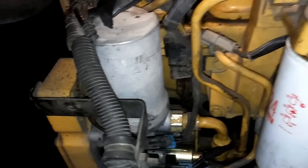So if you're unfamiliar with the HEUI system, basically the engine supplies normal oil pressure — your 30 to 70 psi — to the HEUI pump. The HEUI pump is in place of the 3116 governor. It takes that 60 psi of oil pressure and bumps it up considerably, anywhere from about 800 psi all the way up to about 3,500 psi. It then supplies that high-pressure oil to your injectors, and that pressure is used to push the injector plunger internally to fire your cylinder. It's still firing fuel — it's just using your high-pressure HEUI oil to fire the injectors. The later model C7 also had a HEUI system, but there are some differences, and I think the 3126 was a better system.